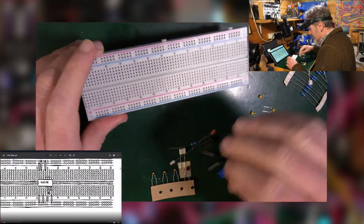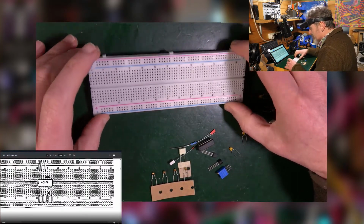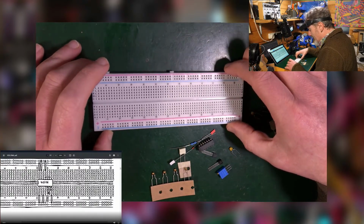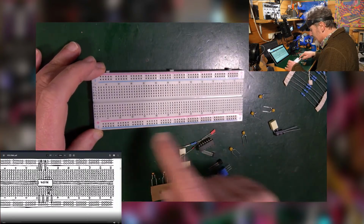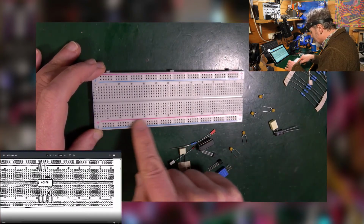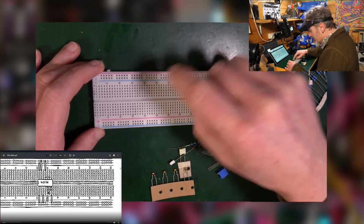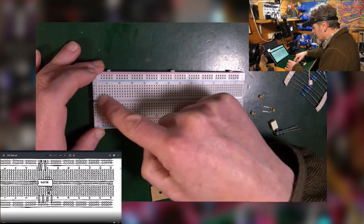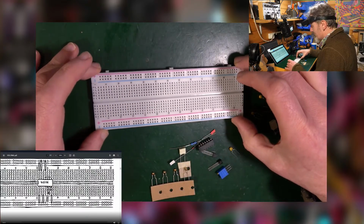Anyway, breadboard. So I got this off Amazon. Cost about a tenner. And what I understand from Moritz's awesome breadboard introduction video is that you have these lines along here, these 2 rows connect this way, as do these, whereas the ones in the middle connect this way, but not across this middle bit. So those 5 are connected, these 5 are connected. There's a gap between, which will stop everything bad from happening.